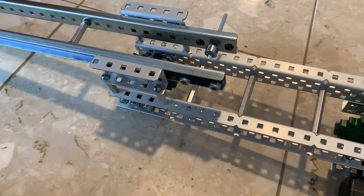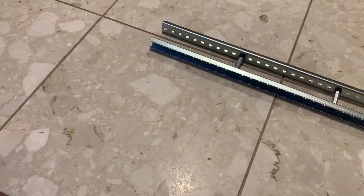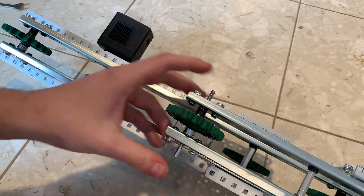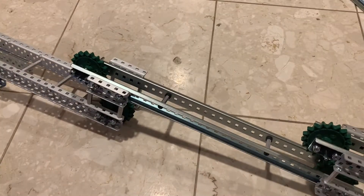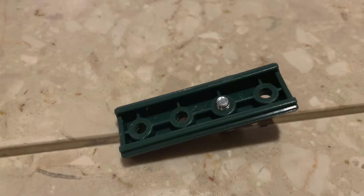We then need to build a third stage. You can simply copy the previous stage and keep stacking them, but I'm going to stop here so I'll build a simple slide set that doesn't have the extra C-channel. After adding one sprocket, slide it on and add another set of bearing flats and sprocket at the bottom. That's the whole assembly right there, and you can see that it can extend. If they get caught on anything, check that the screws going into the slides aren't extending too far in that they get caught in the holes in the rails.